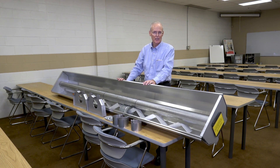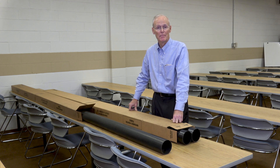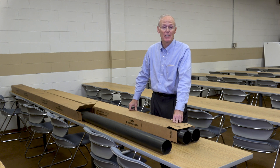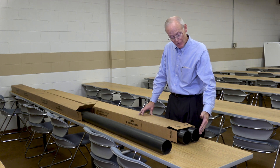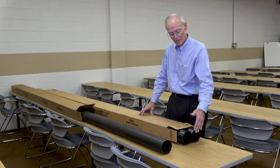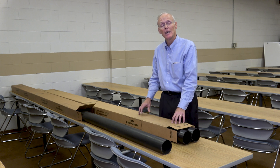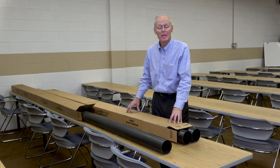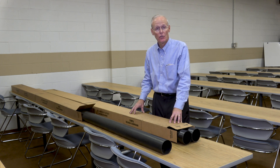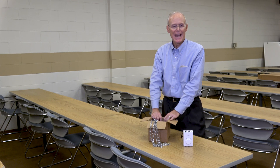So this is a reflector package — we just looked at the reflector kit. In my example I used a 40-foot reflector kit. And you remember the first tube was a different material — it was aluminized steel with a flange that mated up to the burner box. Well, in the package, this is what else you get: this is the 20-foot, 30-foot, and 40-foot of tubing. Now you notice this is a different material — this is a black tube. This is better to absorb and re-radiate the heat. Although you could get the tubing in aluminized steel or even stainless steel, depending on the corrosion resistance that you need.